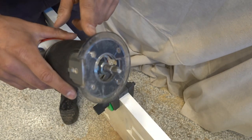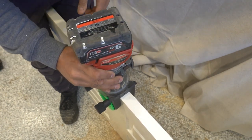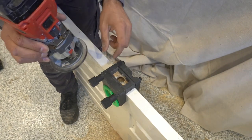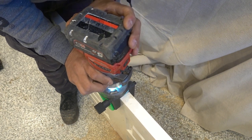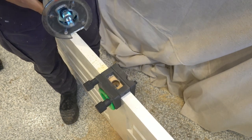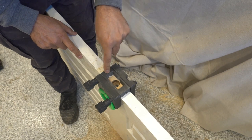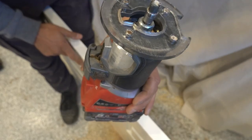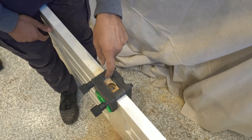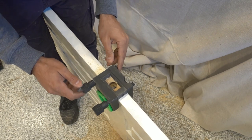Now we simply remove the little insert. Take our router — you can see the little bearing on the side that allows it to travel around the perimeter staying nice and tight to the edge. Drop it inside and router the section out. Once done, remove the jig and take out the little corner sections using the router — that bearing keeps everything clean — to allow the latch to sit in there nice and square and 100% flush.